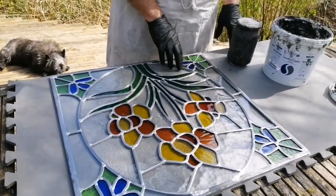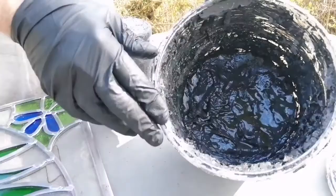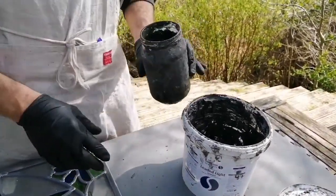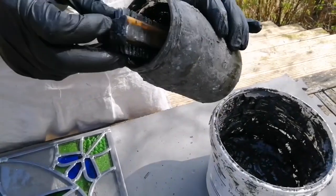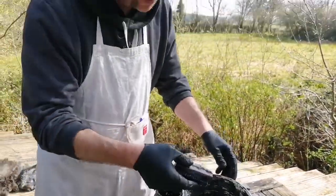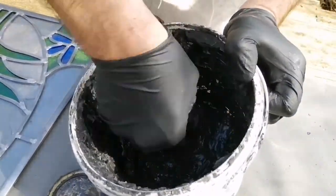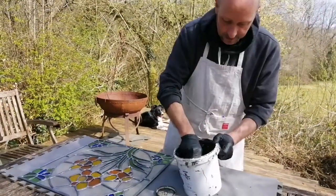I'm now going to cement it up. I only use the leaded light cement — that bucket's almost gone, so I've got another one in the workshop. I use a little nail brush to put the cement on; you can use bigger brushes, but I keep mine in a jam jar with some white spirit, which keeps it cleaner and also softer. I'm just going to give this a mix to get the oil back into it and get a nice consistency.